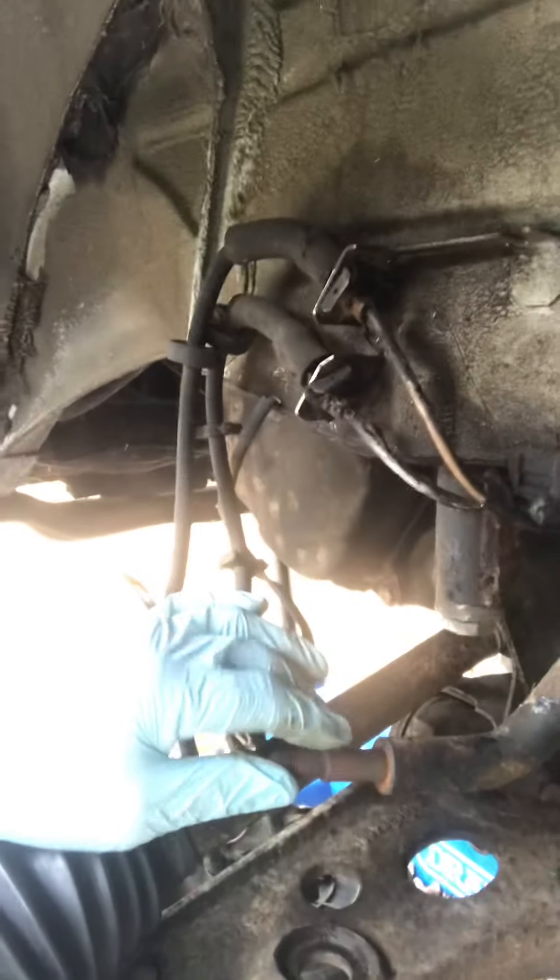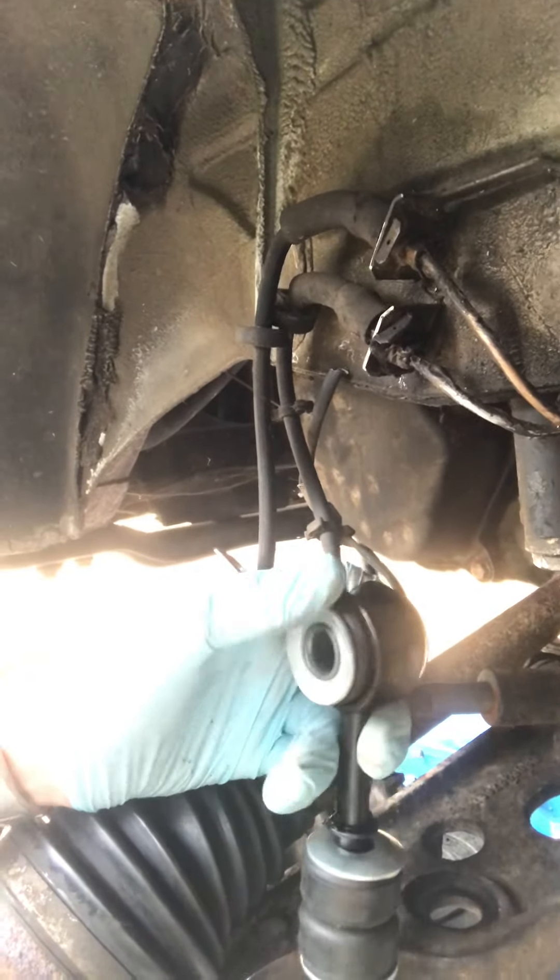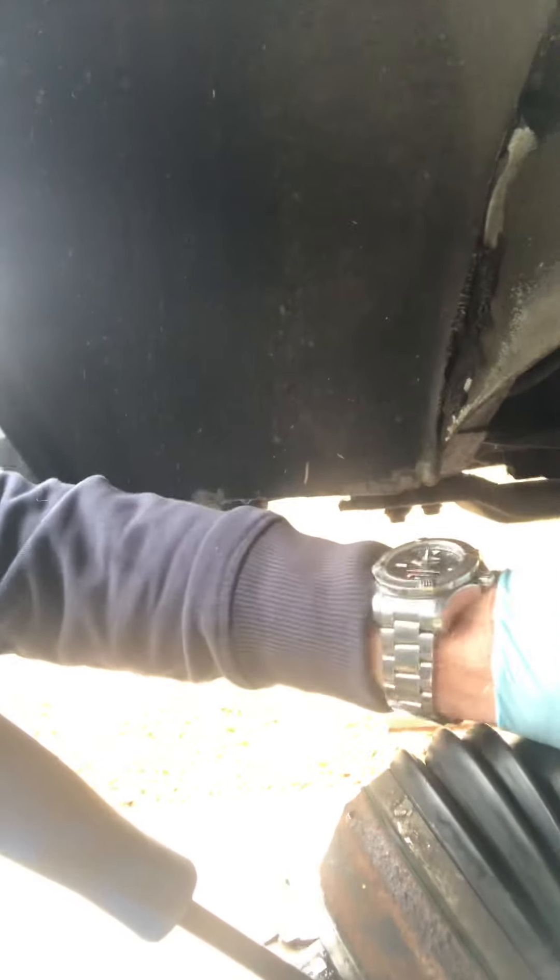So I tried various methods. In the end, for the other side, what worked really well was actually using a blow torch. Kept it on the blue part — the tip of the blue part of the flame is the hottest part. Used that on the whole thing itself, particularly on these end pieces, and got it nice and hot. I did it for about three minutes on the other side, and then with a club hammer I was able to knock the whole thing off the shaft. That worked well.